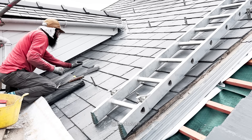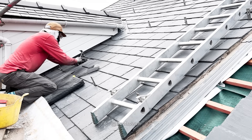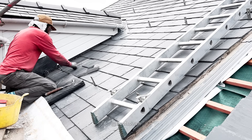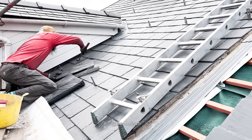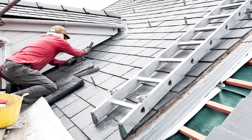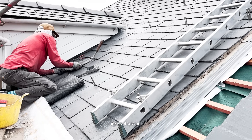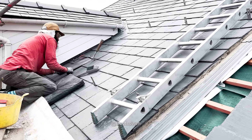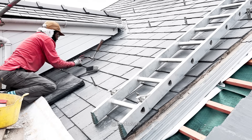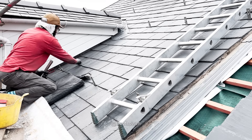If you've got a link to another video where someone's doing this using this kind of bracket with lead, let me know, because YouTube wouldn't find it for me when I went looking a few days ago — that's why I put this video up. You could get a slater or roofer in on a day rate and they'd already know what to do. There's a guy fitting similar brackets — the hook type where it's an L with a bit on the bottom — and he was flashing in lead like this. He was doing a whole slate out, slate back in, and the hook fitted with lead flashing in about three to four minutes. He knew where the rafters were, had all his tools to hand, and knew what he was doing — I'm at 15 minutes never having done it before.